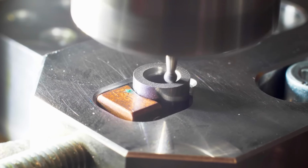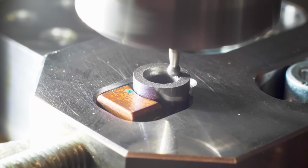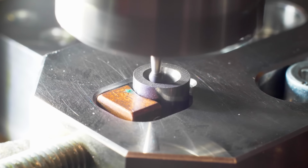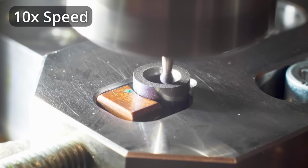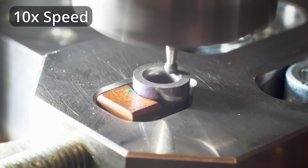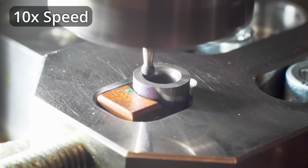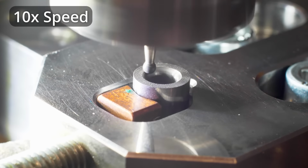So here is the actual grinding process in real time. I start at the bottom of the radius with the ball tool, and then I take the entire radius in one go in a spiral tool path, removing a lot of material but doing an extremely small step over per revolution. Means a very small pitch on the spiral tool path.